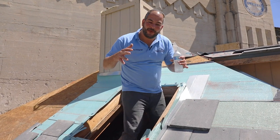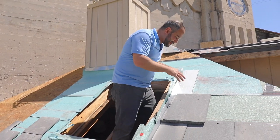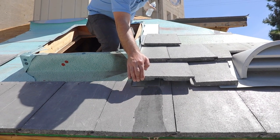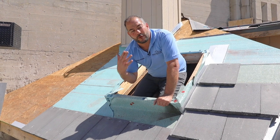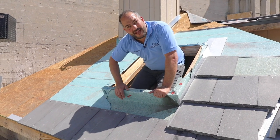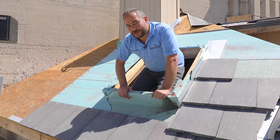Now that we've got this tile pan installed, I want to show you the purpose behind it. Even if we don't have tiles here, any water that's going underneath here is coming out the other end. Now, before we install our head wall flashing — what we call 110 metal, that 90-degree piece of metal — what we want to do is first install a row of tiles, then install our flashing on top of that. I'm going to get started with installing these tiles and I'll show you how to install that flashing.